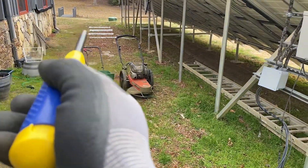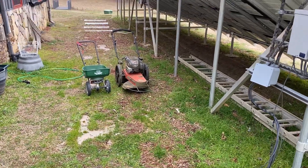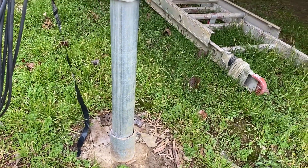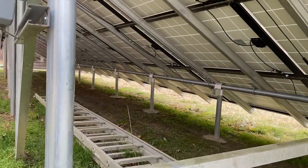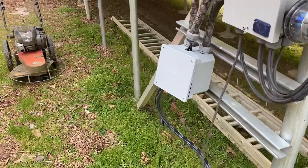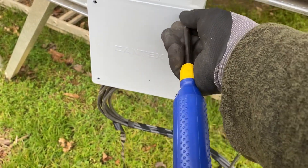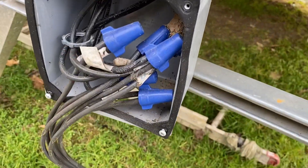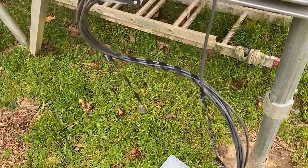The homeowner said the array was too close and needed to be moved, so the guy came out and apparently put in new pipes that were slightly larger and then dragged the array with his truck and concreted it back in. Kind of crazy, kind of cowboy, but this is unacceptable. This guy was an electrician and this is how he left it electrically — this is not PV wire running through here. PV wire is outdoor rated; this is blue wire nuts on number six THHN copper — big wire spliced with blue wire nuts. Not cool.